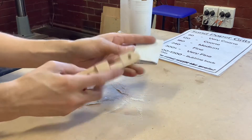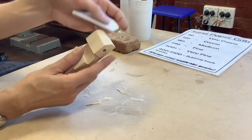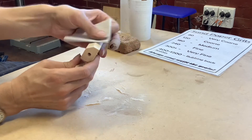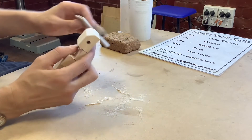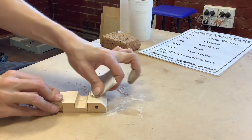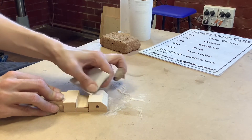You should be able to see that my timber is coming up a little bit lighter — that's what I want. Pine likes to darken in response to UV, so when I sand it back I should end up with a slightly lighter colouring over the whole piece. You can usually tell if you haven't quite sanded enough in one spot because you haven't quite gotten rid of the darkening all across that surface.